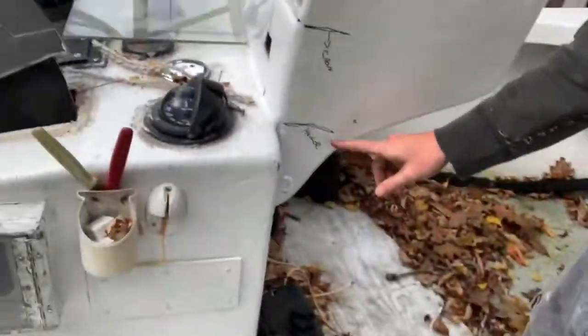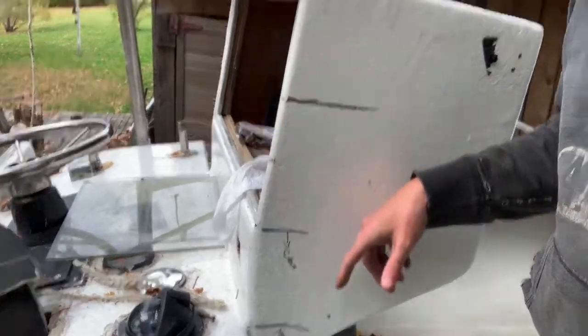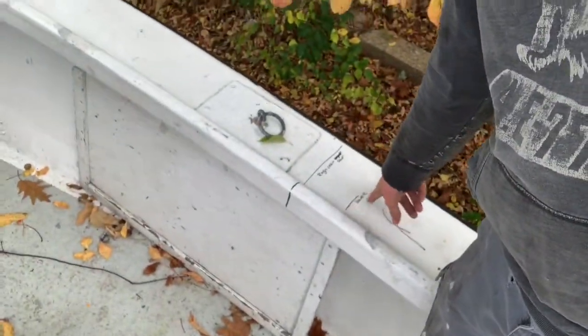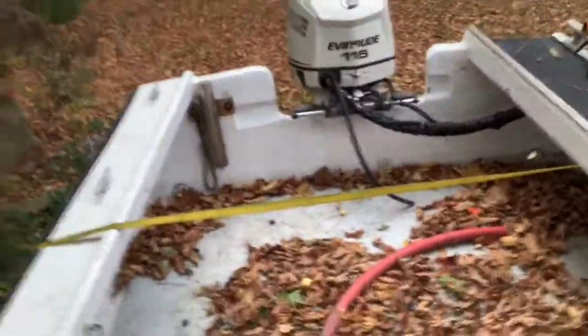What I did was I measured everything off the bow and the stern to get to a point. We came up with 11 foot 6 to the stern and 10 foot to the bow, which corresponds with the drawing — which is actually pretty good and tells me that my scale is accurate. Then we put some new marks for roughly how high the hauler was going to go and the top of the cabin, which I think is going to be at this mark. I don't want to go that high, but enough that you can put a beer or a phone on it and it won't slide off. We've marked out the rough cabin start, which is just forward of a bulkhead in the hull, marked out the hauler, and this mark right there is where the roof of the wheelhouse will end — giving open deck space all the way back.